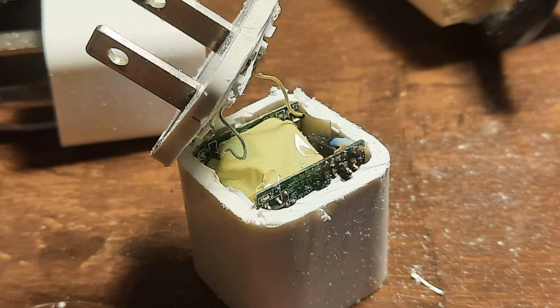For the meters, I thought I could feed them with one DC voltage, right? The AC power meter and a separate DC power meter. But the grounds are separate because if it's isolated, there's a left and a right ground. So they kind of messed up the readout when I was trying to feed them from a single supply. So I had to feed them from two individual supplies.